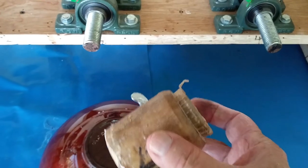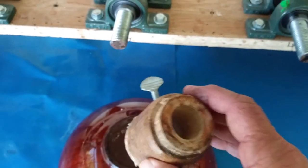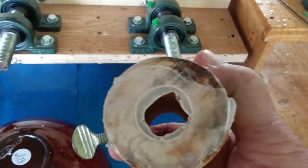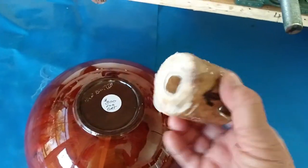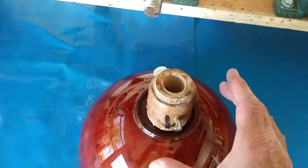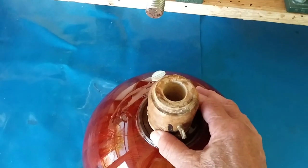And then I put this in the tailstock with a chuck attached to the tailstock. So when I put them together and then put hot glue on here, as you can see, that's hot glue from the last setup, which I haven't taken off yet. So when I put hot glue on that and just bring it up quickly to the bowl, it's as much centered as it can be. Okay, even if it's off a little, not a big deal.